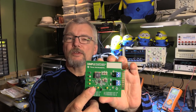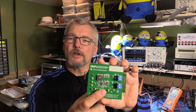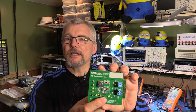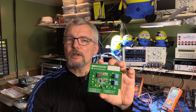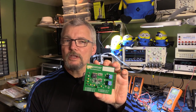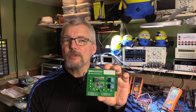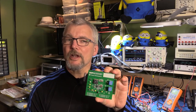The board is set for a 3.3-volt nominal output, but it has a jumper that you can plug in to set the output to 5 volts. We're going to hook it up to my power supply, start off feeding it something like 10 or 15 volts, stick a 10-ohm load on the output, and see how clean it is. Then we'll look at varying the input, measuring conversion efficiency, and testing output response to input load changes. After that, we'll test the output response by putting a dynamic load on there — a power transistor with a small 1-ohm load — using my Agilent signal generator to control the step current from about 1-amp to 2-amps and back. So let's get to the bench, hook it up, and see what it can do.